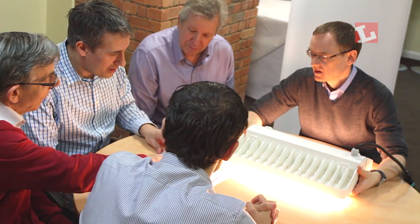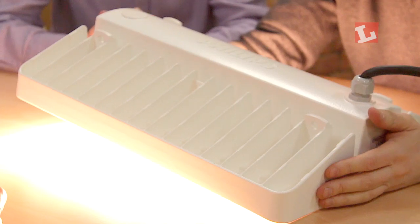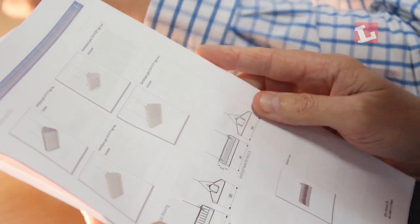What I quite like about this is that Philips quote the life in terms of light output at 50%, 70%, and 90%, and the reason that's important is that you can do your maintenance factor calculations properly. There's been quite a bit of attention paid to things like glare, which can be a death nail of many high-bay applications. It seems to have a square-based light output distribution — buildings tend to be square so square distributions work better. The ease of installation looks pretty good too.